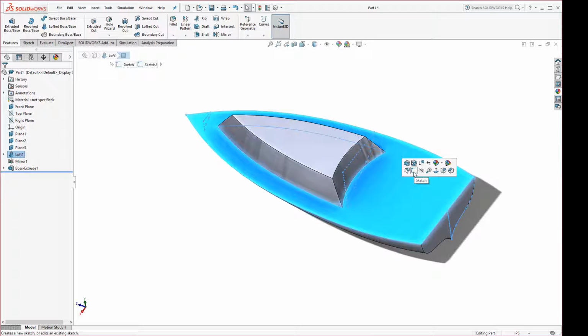Now I'm going to make a little cutout here. Beware, you can shell this to some extent. In reality, I don't know if you'd necessarily be shelling something this small out. You'd maybe chisel away at it on the inside. Shelling isn't always the best thing. The problem you'll find a lot of times is on the tight areas near the tip that it'll fail to shell because the geometry intersects itself. So some little things you could do is cut that little tip off and model something in. There's a lot of different things you can do with that.